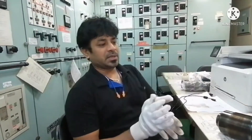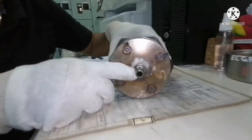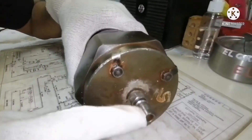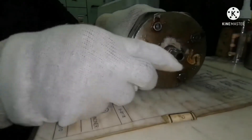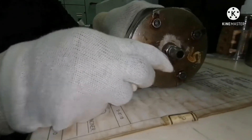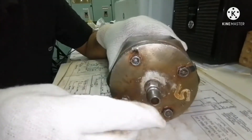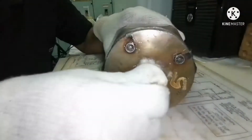The testing of the puncture valve is very simple. All you need to do is fit one air nipple over here — this is for the air inlet. Usually there won't be any nipple here because this will be connected directly with the pipe at the fuel pump. But for testing purposes we fit this air nipple.